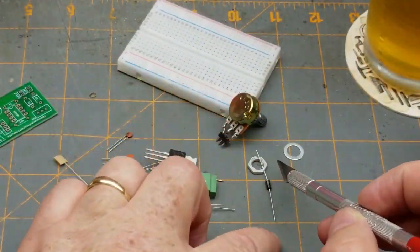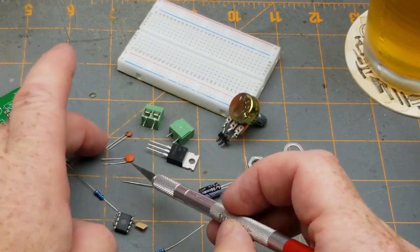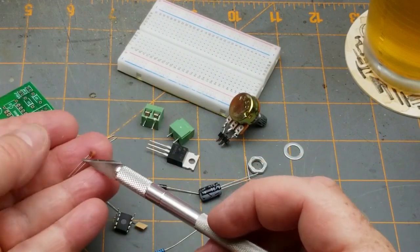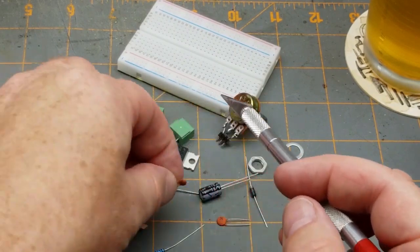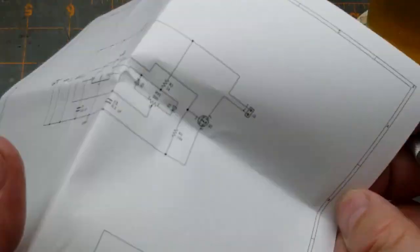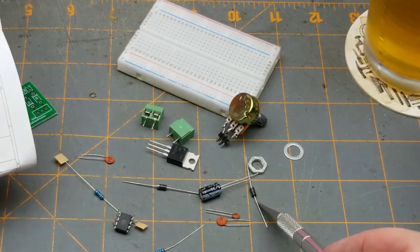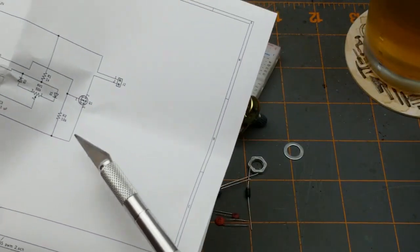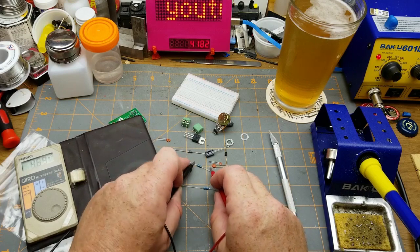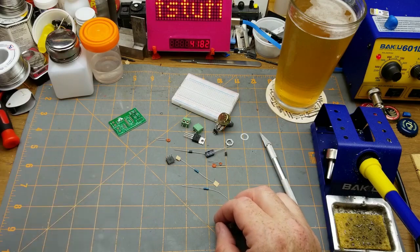Not a bad workaround at all. What else do we have in the kit? Hardware for the pot, a couple of screw terminals, the filtering capacitor, the timing capacitors — that's a 104 — and there's a 103 as well. Then there's the big electrolytic, the MOSFET, two diodes, and we're going to find a 1k and a 10k resistor. The 10k is the one without the paper tabs, the 1k is the one with the paper tabs — remember that so I don't screw it up.